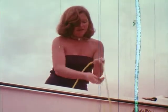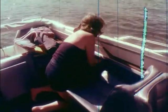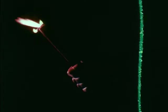All you can do now is signal for assistance. But first, anchor the boat. Lower the anchor over the side — don't toss it — making sure the line is attached to the boat. These are the things to look for to signal for help: a mirror can be seen a long way on a sunny day. With a bright cloth, raise and lower both arms extended from the body — don't wave, you may only get a friendly wave in reply. If it is night, a flashlight is good for flashing SOS: three short flashes, followed by three longer flashes, followed by three short flashes. Flares are also used, but they can be very dangerous. Hold it away from your body and over the downwind side of the boat. Never light it around gasoline.